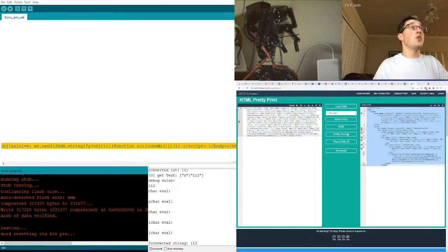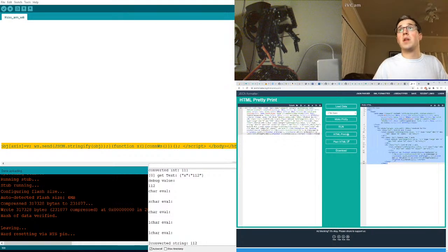So if we press Control N, there we are, and we paste, and then we press Control F, wait for it. Here we go. We're going to find backslash this guy, and we're going to replace it with just that guy. Replace for everything. Now, we're going to copy everything and throw it back into this guy. Bam! Now it works. Make pretty.